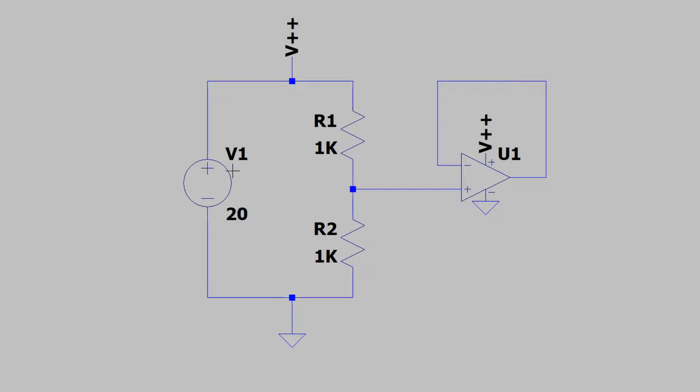To maintain the equal balance of splitting the voltage supply by two, we have to isolate this power supply from the rest of the circuit. A voltage follower accomplishes this because the op-amp has very high impedance between its two inputs and very low output impedance. So we send the 10 volts from the voltage divider through the voltage follower to isolate that virtual ground — if we add a load from that point to ground it will not affect the voltage divider.